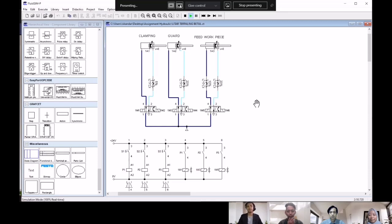All right. Hi, my name is Megat Iskandar. So I'm going to explain about the electrical circuit. For the electrical circuit, we give 24 volt electrical supply. So the first one, we are going to push S1 button as explained by Niesya, Farhan and Nik. The S1 button is going to move the electric towards the first circuit until the P1. The P1, this one is relay.